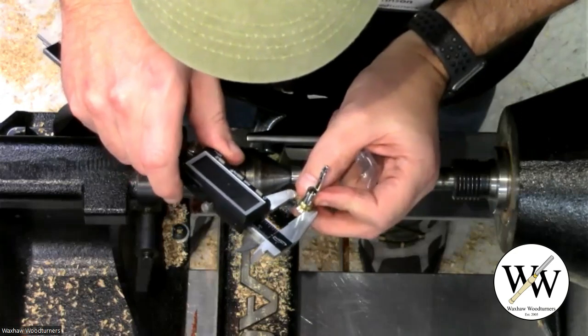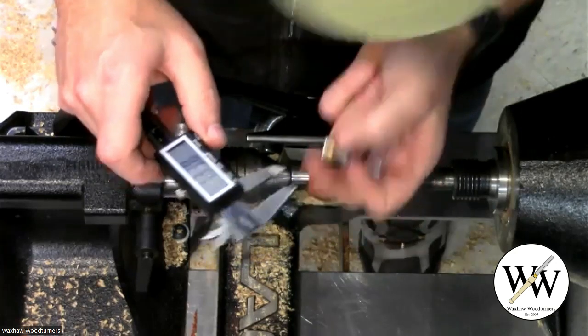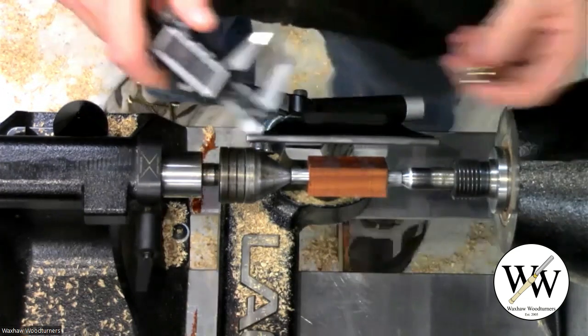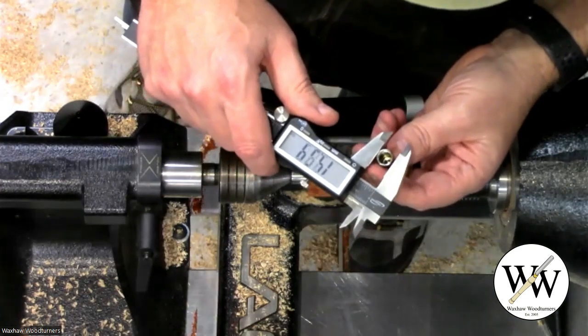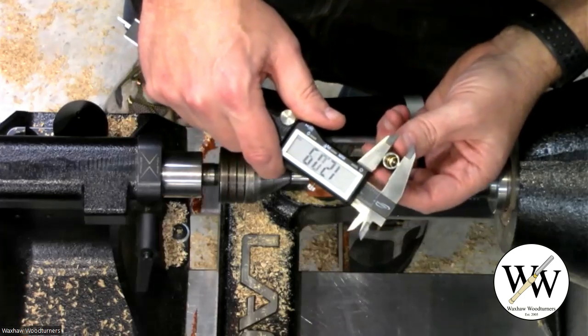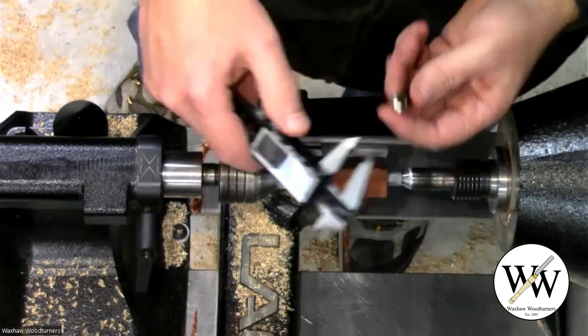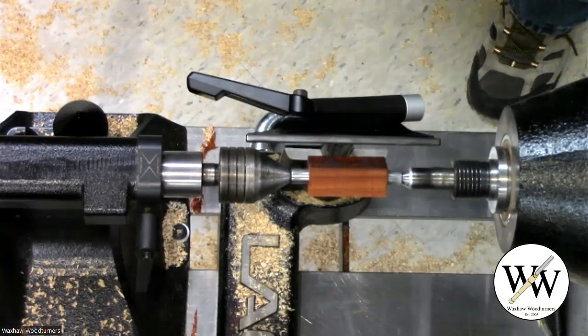And that comes out to, well, this is going to be, no, that's not a good one. That's the cap. Oh, that's the clip part. Let me go down to where it actually meets the nib. So the new bushing's mic'd out at 1194. The component itself mic's out at 1209. So a little bit of difference.